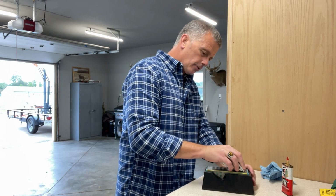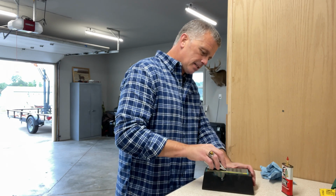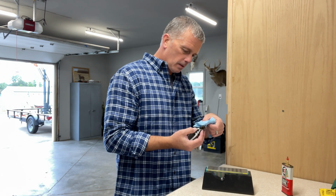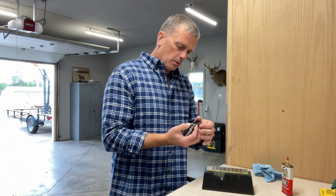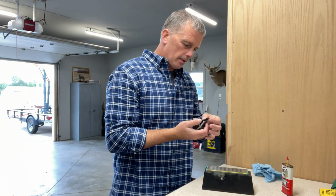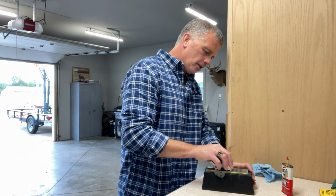Turn that over to the 600 grit fine stone. Nice consistent pressure. We definitely have a burr on that back side. Oh yeah. And as you can see, we're already getting more shiny there. We're taking just enough material off to shine that up. There's definitely a burr back there. I'm going to go ahead just a few more, a little bit lighter pressure.